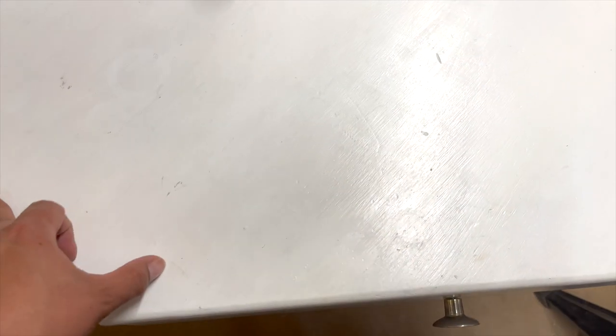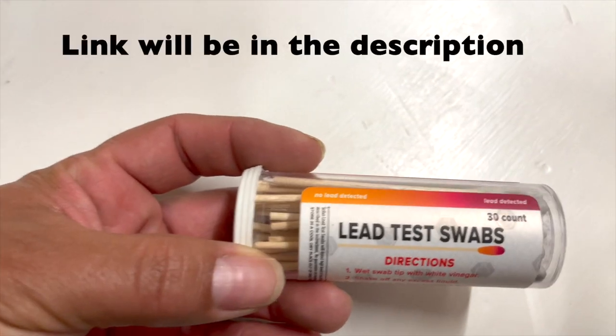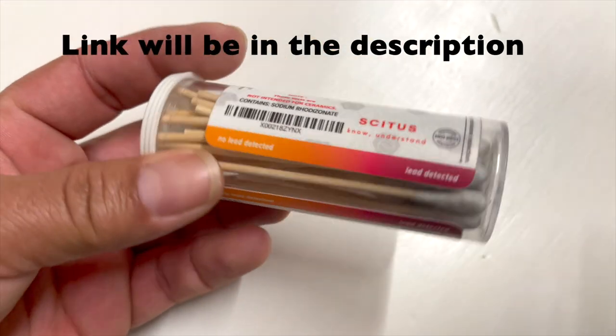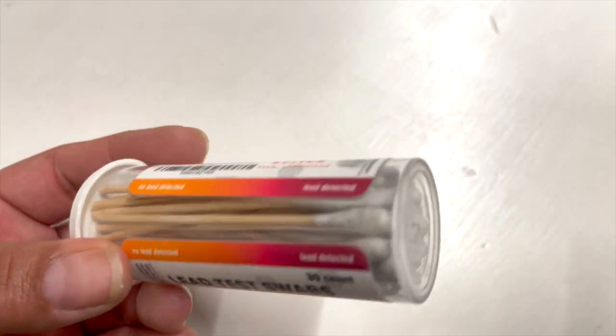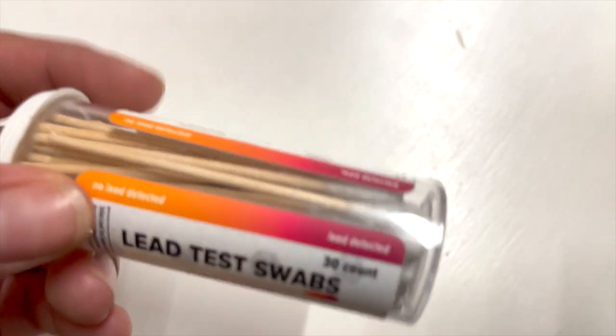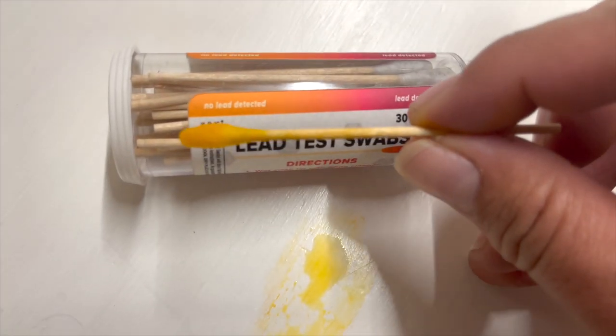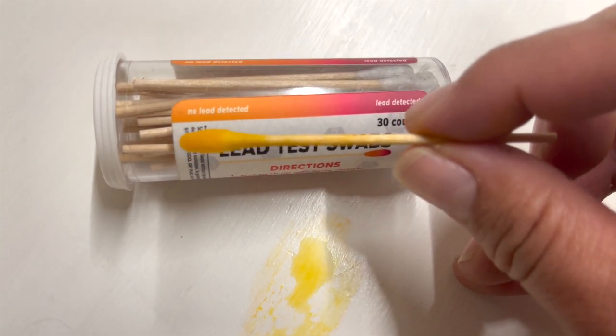To make sure this paint was going to be removed and disposed of properly, I decided to go ahead and test it for lead using these lead test swabs, which I will leave the link in the description for. You just dip them in a little bit of white vinegar, rub them on the surface for 30 seconds, and they let you know whether or not lead is detected. None was detected, so we were good to go.